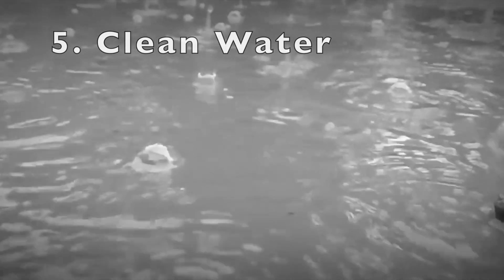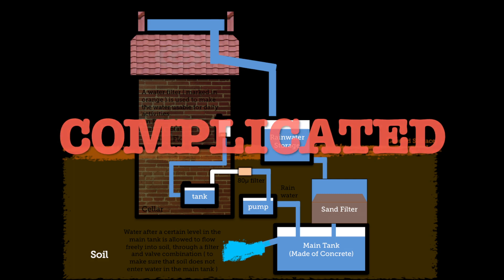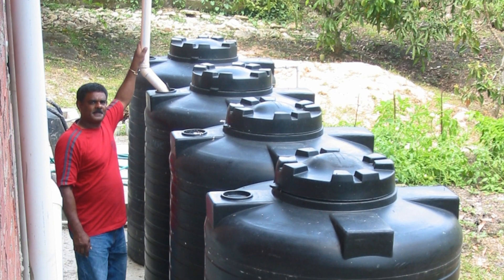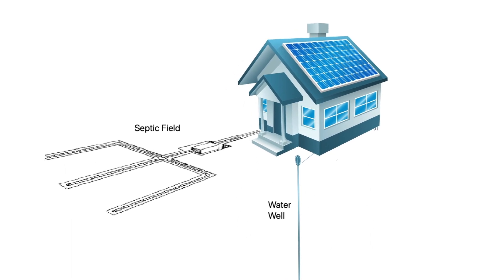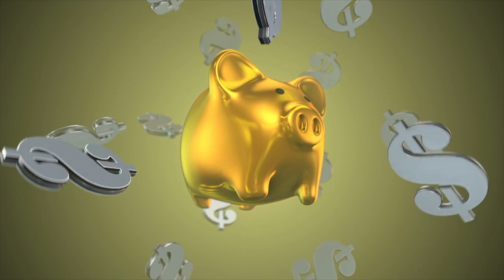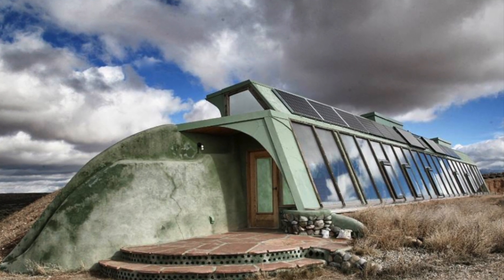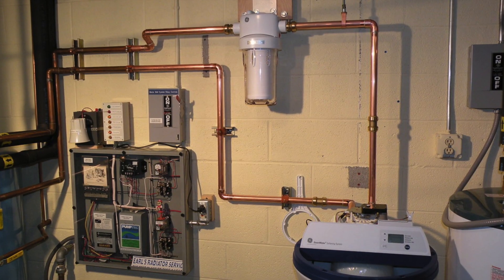Earthships praise the idea of saving rainwater, filtering it, and then after using it in one place, recycling it to the toilet. Every time I read about this I ask: why don't these people just drill a well? Most locations can drill a well and get good clean unlimited water 50 to 400 feet down — way less cost than installing multiple cisterns to hold rainwater. No need to recycle the well water from shower to toilet; you just use a septic field system and all the water recycles back into the ground. Imagine the cost savings of not having five to six cisterns as holding tanks and never having to worry about your water running out if it doesn't rain for months. Most every rural acreage operates like this and has for over a century, but earthships designed a system to use rainwater that costs ten times as much so they can feel environmentally smug recycling rainwater that has to be highly filtered from the roof.